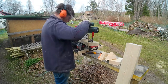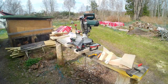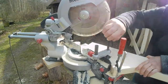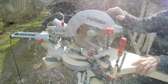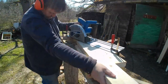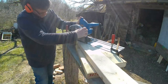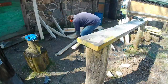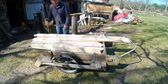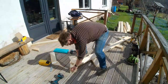I fixed the miter saw onto my workbench outside and screwed it down so it was permanent for this job. It was quite an effort to set up these jigs, but then you go through the pieces really quickly and know that every one is replicated perfectly. There was one angle for the collar tie bar which was really difficult, so I needed to use my track saw for that, and then the jigsaw to finish the end bits. Here's the trusty trolley all loaded up to take to the next part, which is assembling all the trusses.